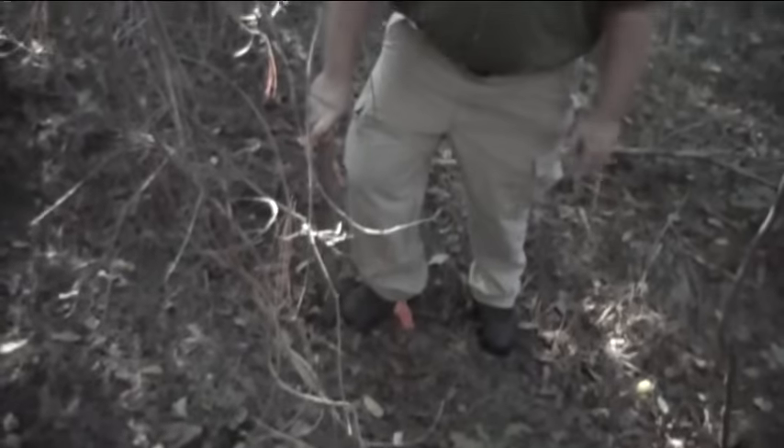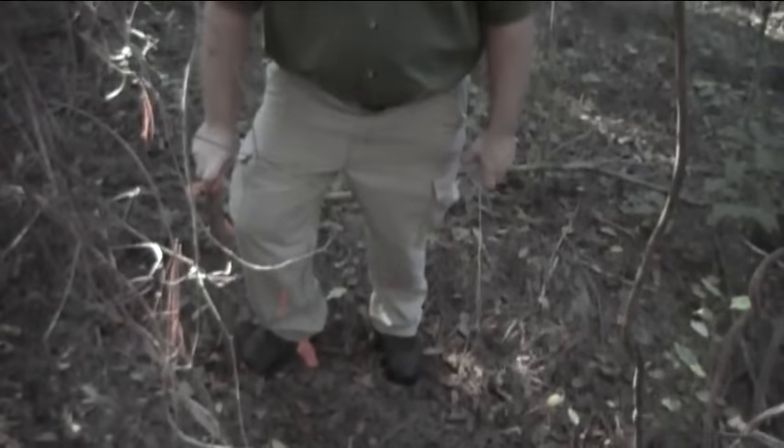Now that we're down in the woods I want to give you a better idea of what this looks like. The compass is set to a bearing of 216 degrees and you can see the red part of my compass is pointing toward the north. All I have to do is keep that red arrow pointed toward north and walk forward toward the direction arrow. Well, we've done it — we went over 600 feet through the thick of the woods and came right across our rebar pin for the other corner of the property. We're just trying to fence off the back of the property right up near the house where the kids play and some of our domesticated animals are. The string is still up there about another 300 or so feet, tied off to a tree right in the middle of the fence line as a reference point. A simple protractor, the survey map from when you bought your property, and a couple-dollar compass from the department store can get you several hundred feet through the woods to the pin you need to find.